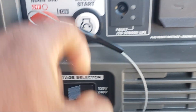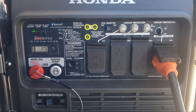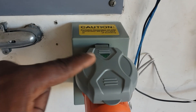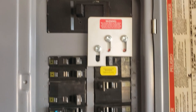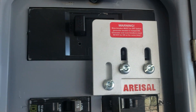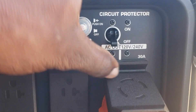Make sure you're in 240-volt mode because you're powering a 240-volt home. Let your generator warm up. Now go prep your inlet box. Come over here — see this right here, it's off, that means you don't have any power going to the house. Once you have power it's going to turn green. Turn your main off, pull this up to introduce power to the house so your generator can work. Once you come back to your generator you can just turn your power on right here.